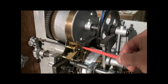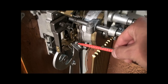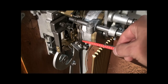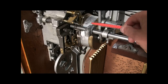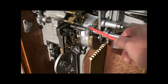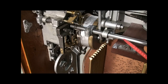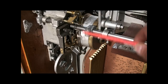But at the same time that this drops in, it's connected down to this second lever, the stop lever, which then causes it to retract, pull out of the way. And once this second stop arm pulls back out of the way, it allows this spring motor to complete the one half of its rotation, which causes the disc to be unclamped. First thing that happens is this rolls off of the high point and allows this to unclamp the disc, and then this roller bearing will fall off of that pattern and let the straps lower the disc back down.